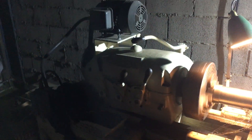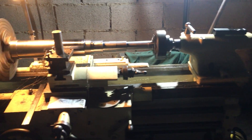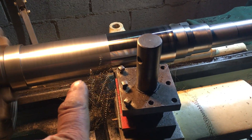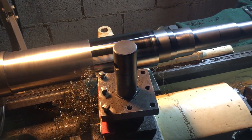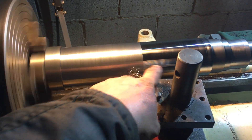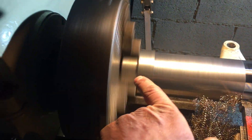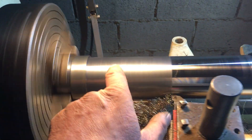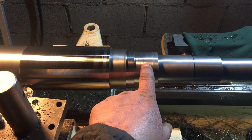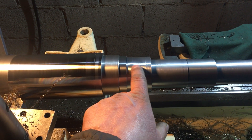Do you recall the old Holbrook lathe that I did up? That made this shaft. It was originally 100mm — 10cm. I'm machining this last piece down to 90mm to fit a keyless bush. One taper bearing will go in on that piece inside the chuck, and the other taper bearing runs here. It's a step down to the carrier bearing I'm putting in — that ball bearing of about 70mm, or 7cm.